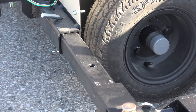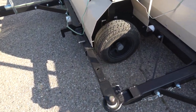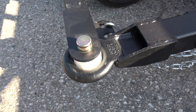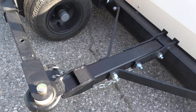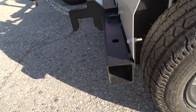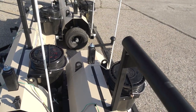You can slide that arm in and those won't stick out anymore. On this arm that sticks out of the lead sweeper, you've got a big bushing that goes through your pintle ring with that pin on top, which is also secured on the bottom with a linchpin. That's your towing force controlled. Here's a look at the secondary sweeper — the second row. That bracket arm would just fit right in there and then the pin goes through the top. These are all interchangeable — there's your towing, there's your rear stability on the back.